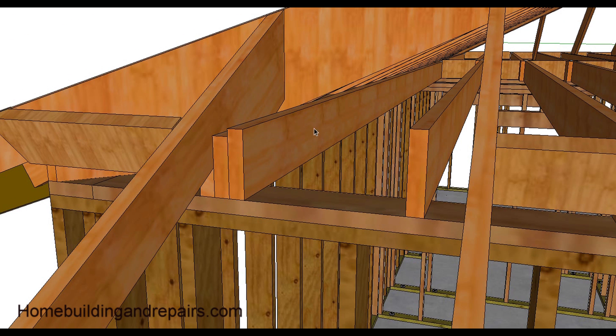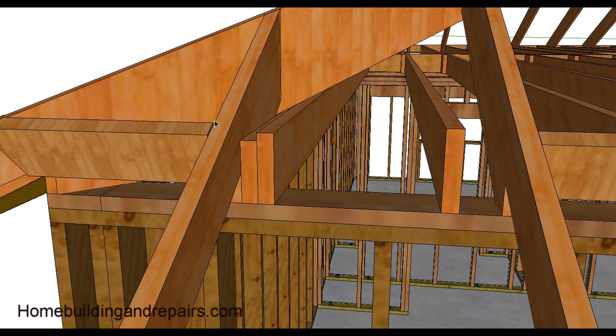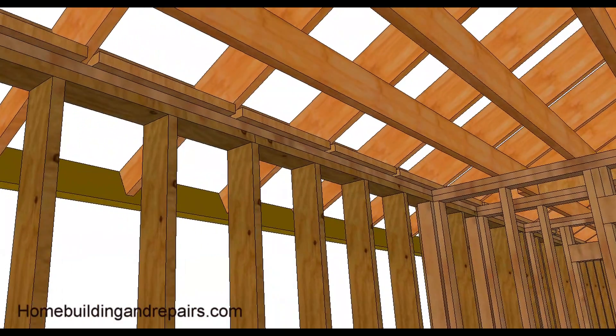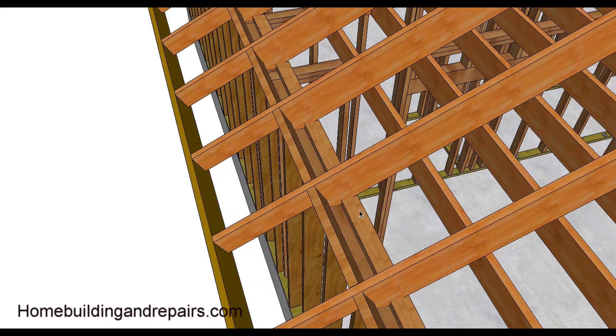It's not uncommon to have regular ceiling joists — I believe these are two-by-eights — and you can see here where it drops down a little bit. As you get closer to the hip or closer to the wall on this side, you might need to make smaller joists; you might even only be able to get away with using two-by-fours in some cases. So keep that in mind when you're building. Usually this is how we finish the corners, with some flat blocks — let them overhang about an inch and a half, and that'll be for your drywall backing. They simply nail on top of the wall framing plate.